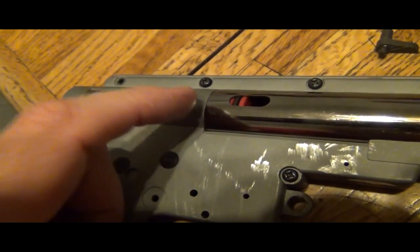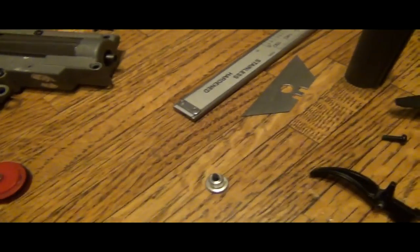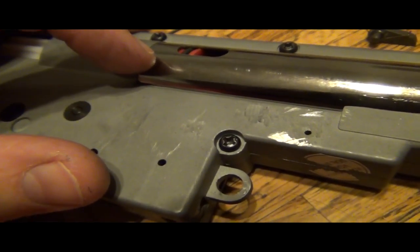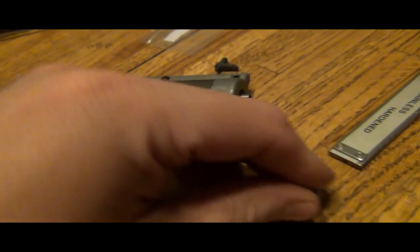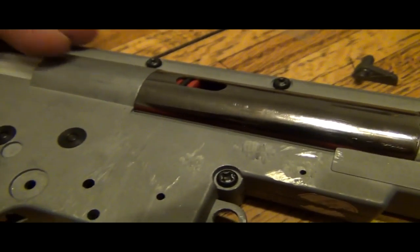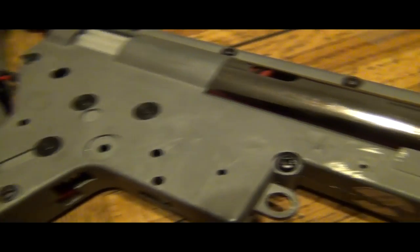However, I do not feel comfortable with the setup, so what I did was I used one of these, flipped it upside down, or backwards I guess, and screwed the piston head on inside. So even though it works, I believe the threads that are screwed on are a very small amount. So what I'm going to do is take it out and dremel off a small section so that it actually has more threads going on that piston head, so it has a higher chance of not failing. Other than that, everything's looking good so far, so we're going to go ahead and get that closer to being done so I can run my tests that I want to.